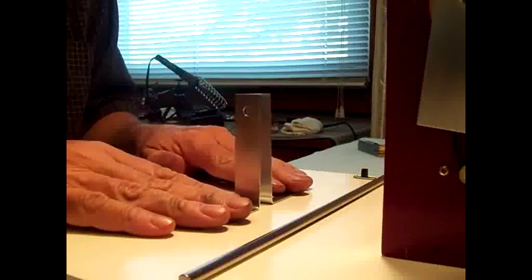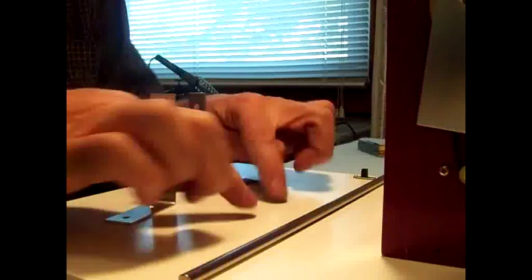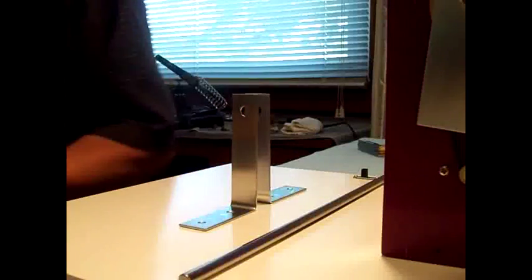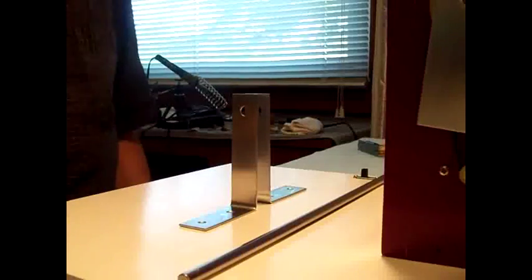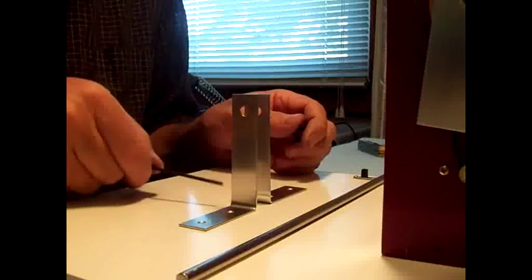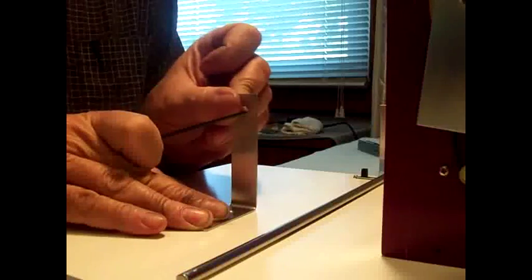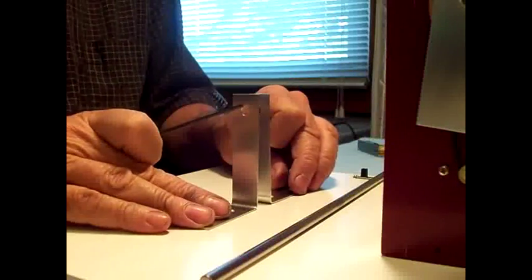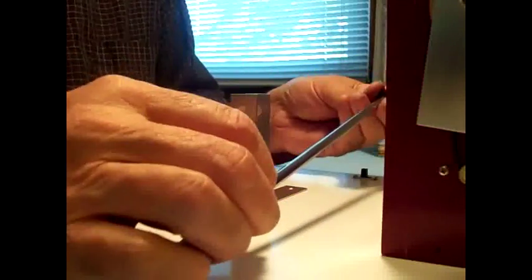Getting ready to put it together now. Got my center marked on the base and two lines where it goes. The first thing I'm going to do is take a shaft collar and put it between the two brackets at the top. This is a little bit different than the Shatner winder base — they had just a piece of angle on one side, but it was a thicker piece of aluminum angle iron. I didn't have anything thick enough, so I figured one piece would be too flimsy. Two of them side by side a quarter inch apart would work just fine.